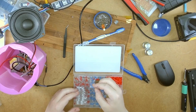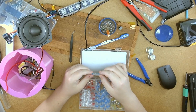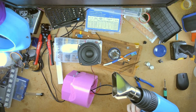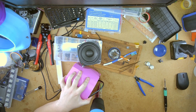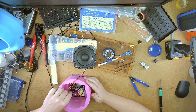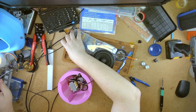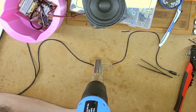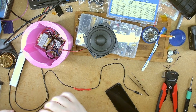I would like to thank Bringer Studios for a short about these little things, otherwise I would never have known — these are solder seal tubes. You put one end of the wire in there, slide that through, twist them to the other end of the wire, put that over a heat gun — and when I said heat gun, I meant probably the cheapest heat gun you can buy. And that's the audio cable done, so let's test if it works.